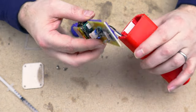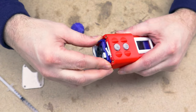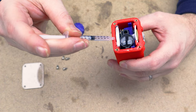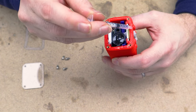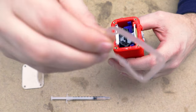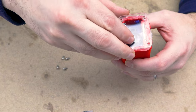We've got a little shim which just holds everything in place and fits in like so. A firm push and that's in place. Now we're going to slowly slide everything in together — make sure this wire here stays up and doesn't get in the way. We're going to use a bit of silicone grease just to help keep any water out. Caves can be extremely wet and muddy and generally not very friendly to electronics, so we want to try and protect our device as much as we can. I've got a nice little sheet of silicone which I've laser cut into just the right shape. That goes on there with another layer of grease.